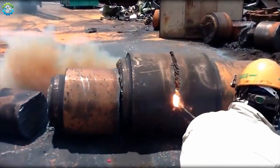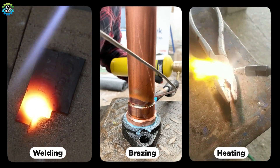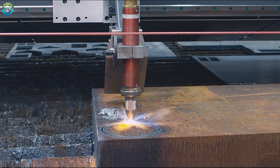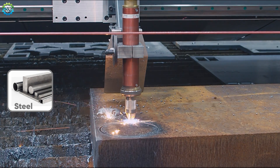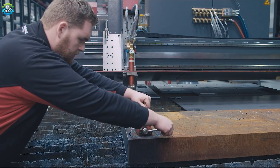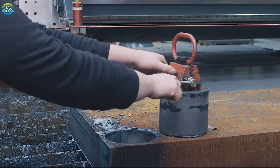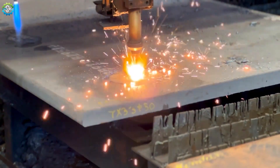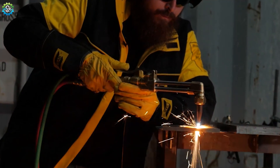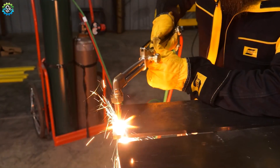It can also be used for welding, brazing, and heating in addition to cutting. Oxyfuel cutting is primarily used for ferrous metals like steel and is not effective on non-ferrous metals like aluminum and copper. The cut quality is generally lower compared to other cutting methods like plasma and laser cutting, and the speed of cutting is slower than some modern cutting technologies. Handling oxyfuel cutting requires proper safety measures against high-temperature flames and explosion of fuel-gas tanks.